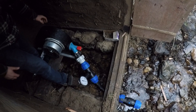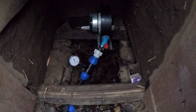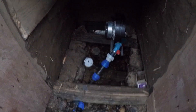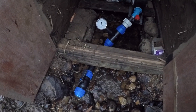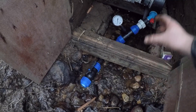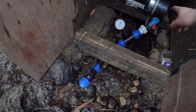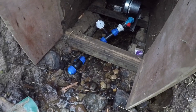That is essentially how it sits. I need to make some adjustments — it's leaning forwards — but that is essentially where the intake water comes in and the adjustment is on this needle valve. I'm going to do a bit of figuring out, cut some bits of wood, make a base for it to sit on. Anyone wondering why I've done it like this instead of using flexible hose — it's because I've got the least number of curves and I can use fairly large pipe for a fairly short distance. My calculations of losses show about 300mm of head for this section, and generally about 5-6% of full rated power in pipe losses.